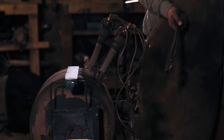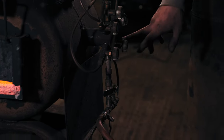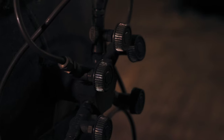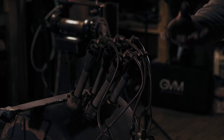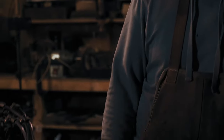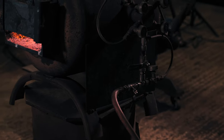Just to explain the forge slightly: you've got the main on-off valve for the gas, and you've got this bypass system, which when you shut this one off, the gas will bleed through and feed these at a lower rate. That would allow a lot more gas through - this is the bleed system. And then each one of these is adjustable as well. You've got five burners to create a nice even heat in the forge, and to be able to turn it right down without the blow-back risk from the back pressure for a single or double burner. This one kind of needs rebuilding now - the inside's getting a bit burnt out, and every time you build one of these, you better it. I think this is like the third or fourth one so far.